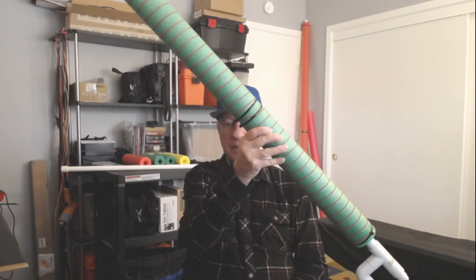I developed a way to do that by winding ordinary hookup wire around a large three-inch diameter pool noodle — it kind of looks like this. This antenna is about one-fifth the size of a normal vertical dipole. You can operate it in vertical or horizontal mode. And in addition: no radials, no balun, no tuners, no loading coils, no ground planes, nothing. Just this. For an average vertical or horizontal 10-meter dipole, which would be about 17 feet long, I've replaced it with this guy right here.